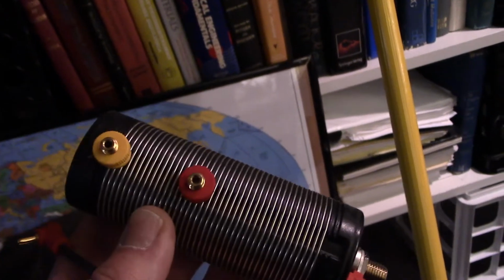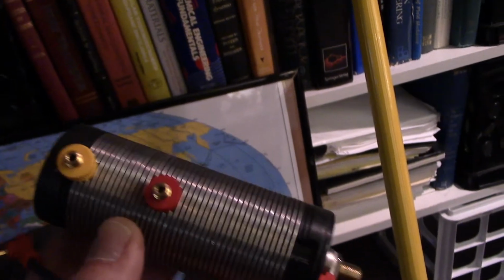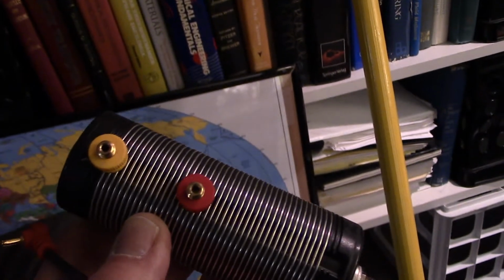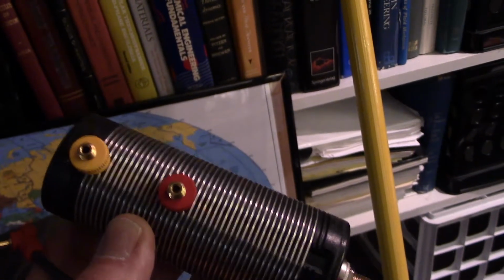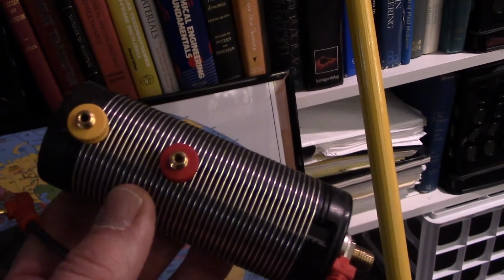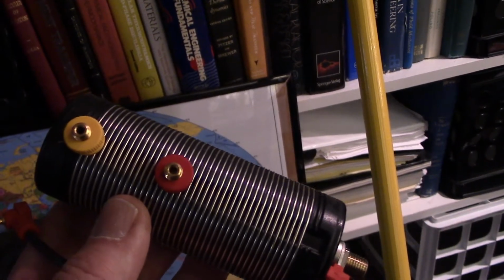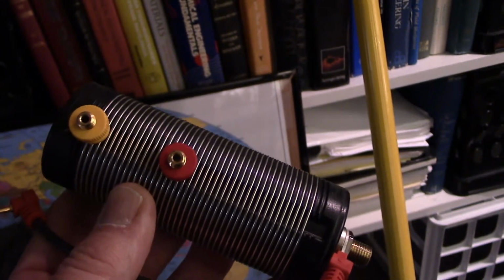Usually I connect the appropriate length counterpoise wire and adjust the counterpoise wire to get my SWR below 2.0 by adjusting its length, and then use the KX2 antenna tuner to fine tune that SWR, and usually it ends up down around 1.5, 1.3.